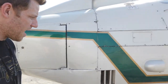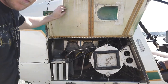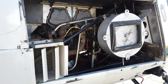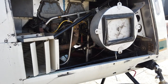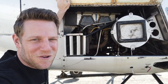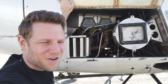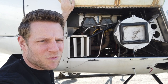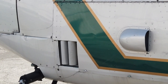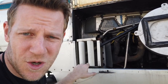Just in front of the luggage area, we've got the engine. It's accessible via two doors, one on each side — this flips right up. It's a Lycoming HIO 360, which is a fuel injected and turbocharged engine. 360 refers to cubic inches — that's 5.9 liters. It's a 5.9-liter turbocharged four-cylinder making 205 horsepower. By automotive standards, that's a lot of displacement and forced induction for only 205 hp, but in aviation, reliability outranks pure power. This is the intake side — air comes in through a scoop on the door, through the air filter. This is the oil cooler.